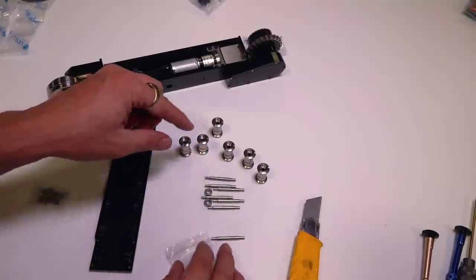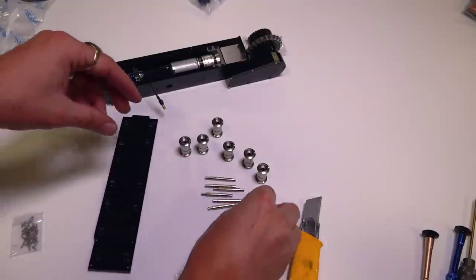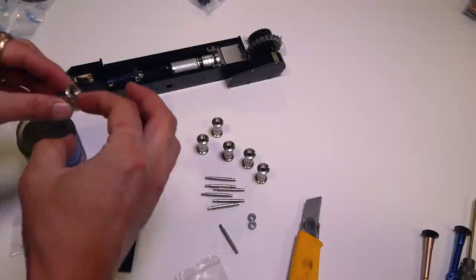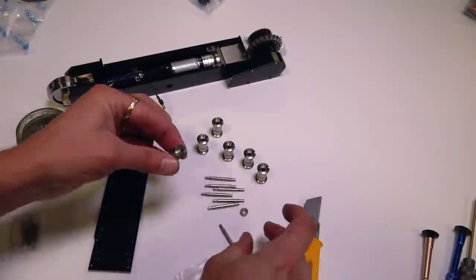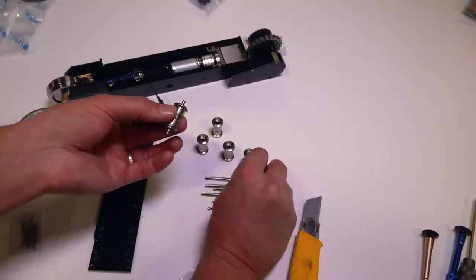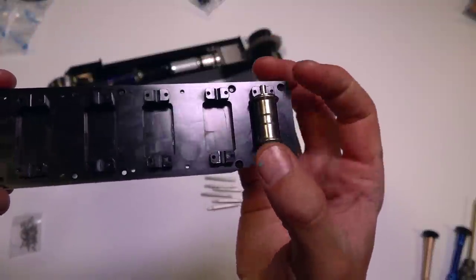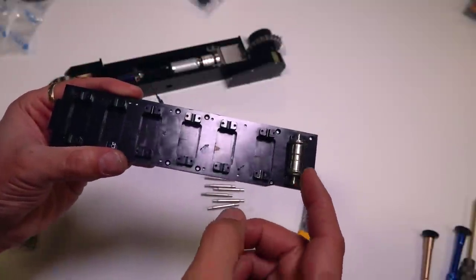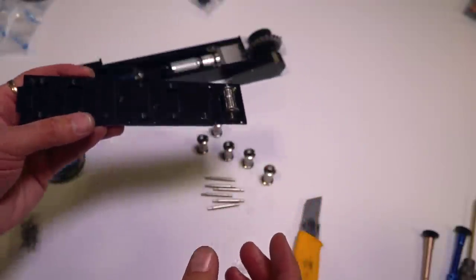Let's get these pins out — these are the pins going through the rollers. I want to grease the inside of this roller on both sides. Not too much, because I don't want dirt getting in the bearing, but I want good resistance against humidity. I stick this pin right through the roller, and out pops some grease which I can use in the next one. Then drop it right into the plate. If you're building along and have a hard time, make sure your bearings are squeezed in on either side. We want to do seven of these per side — 14 total. 14 screws on one side, so 28. You're going to be sitting there for a little while.